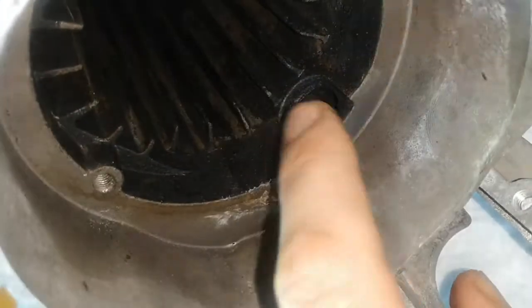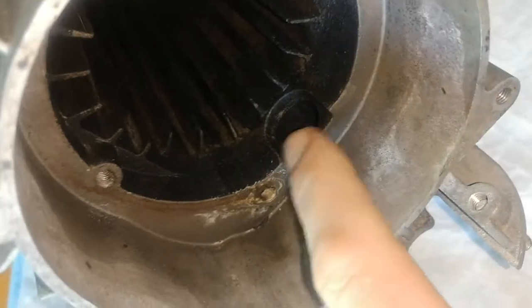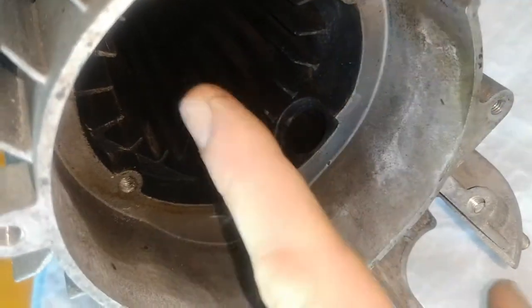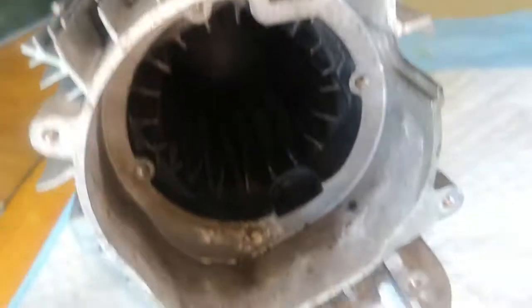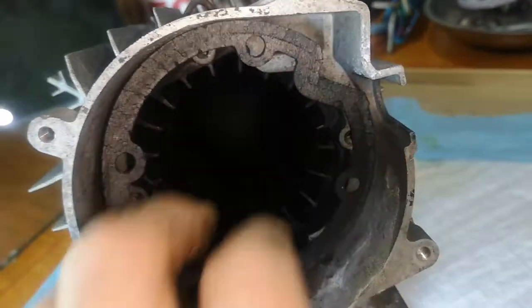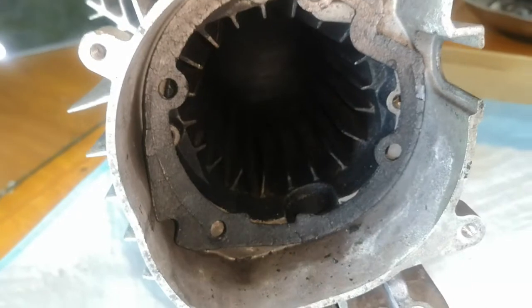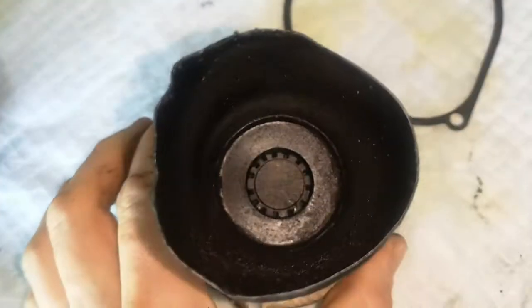The water was probably blocking the exhaust and causing some back pressure up into the burner. As you can see, there's the exhaust — that's where the exhaust goes out. The burner pushes air down in there, and I think the blocked exhaust port pushed air back up which caused this seal to start leaking. You can see there are all these cracks, and yeah, there was oil coming in.